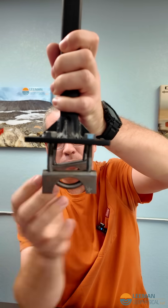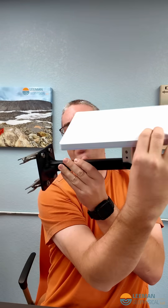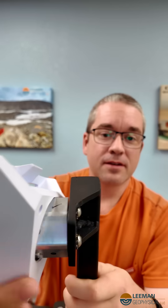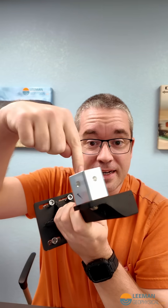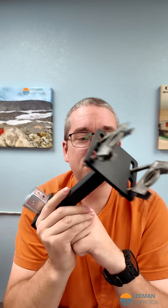This weighs more than the Starlink Mini itself, but it has U-bolts that let us attach to a tower or pole and stick out so the panel can fit and point in any direction. It's got a hex with holes in the edge that goes over the mount so you can install it in any orientation — the holes let a screw retain it positively in the vertical direction. There are set screws with smiley faces on the bottom that let you rotate it, giving you six possible orientations and full rotational pointing. This bracket will hold up to anything your tower can handle, and probably more than the Starlink itself.